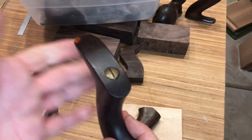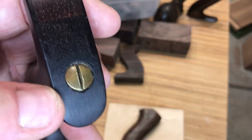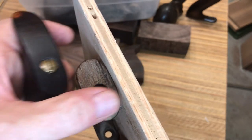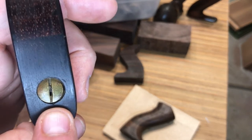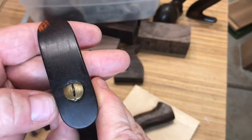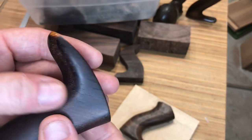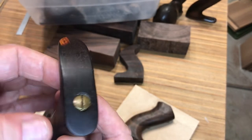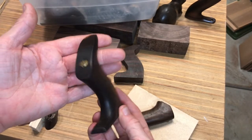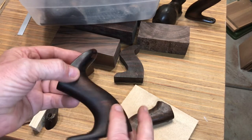Here's another one — this is Brazilian rosewood with a repair. If I look close, you can see it was cut very similar, right at 3 and 9 o'clock, and we left part of that hole exposed so that replacing the cylinder and putting the geometry back in was easy. Under certain light you can tell there are some laminations and some other material in place. But from a glance or from three feet away on my bench, I think that's a beautiful repair with a lot of good years to come.